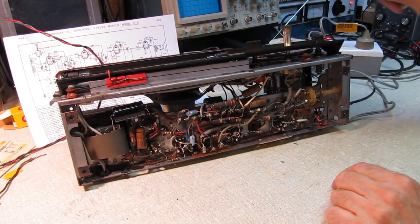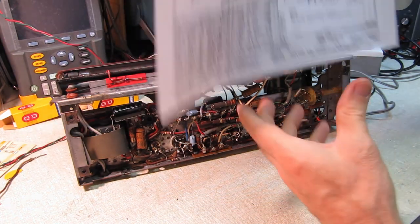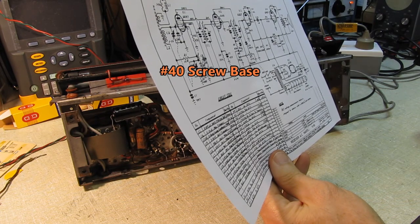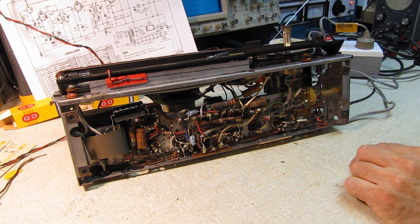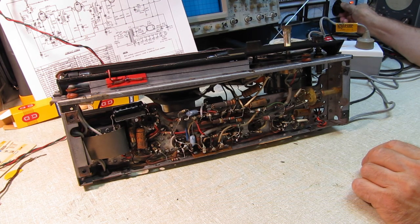I've got plenty of those. Does it say what they are? I'm going to guess 47s perhaps. 6.3 volts, 300 milliamperes, yeah, they're across the filament line. 47 would be fine. Well, let's see what we got. We're still on the dim bulb.